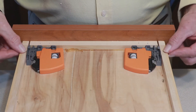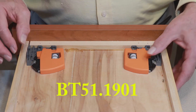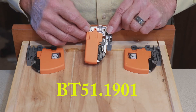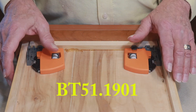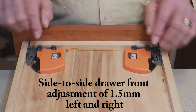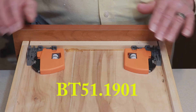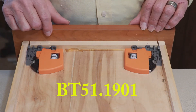Now we're going to discuss the front locking devices that have side-to-side adjustment built into them — this is a really nice feature. They're not much different than the basic front locking device except for the side-to-side adjustment; otherwise the function is the same. But the side-to-side feature is an extremely nice thing. In the cabinets that I built, the side-to-side feature saved me a couple of times. They have the three-millimeter up and down lever, the side-to-side adjustment left to right, and a spring-loaded release lever for releasing your drawer runner.